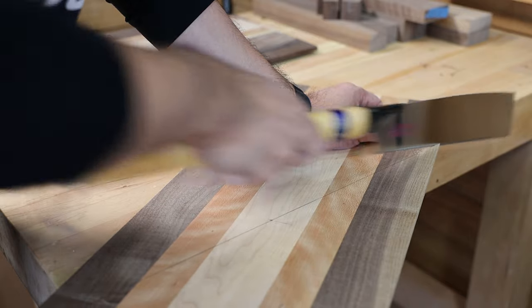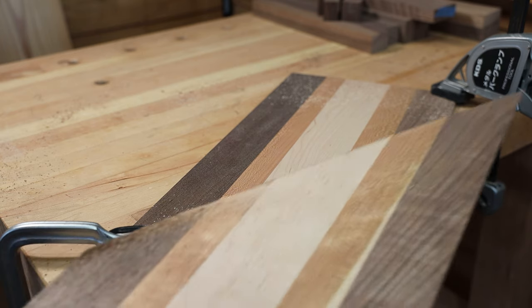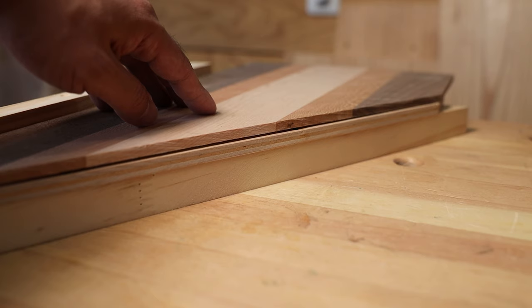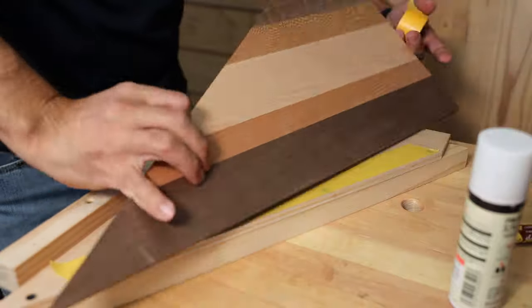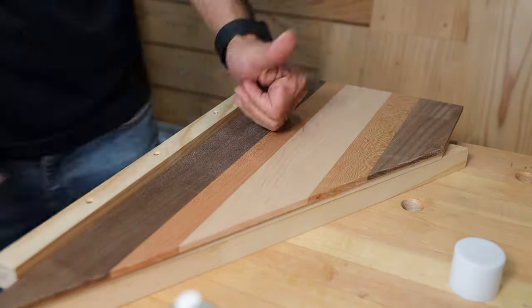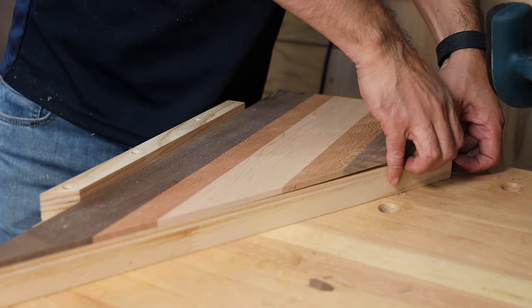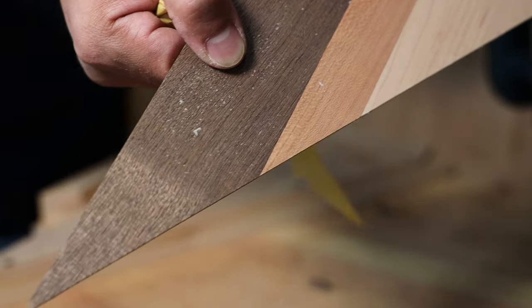These thick veneers needed to be divided at 30 degrees. The veneer is bent, so I kept it away from the trimming jig. The painter tape method is very useful with CA glue and activator. The tabletop needs exactly the same angle on each veneer, and sharp edges.